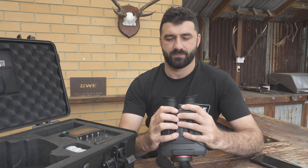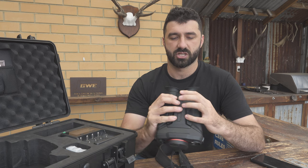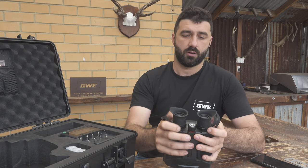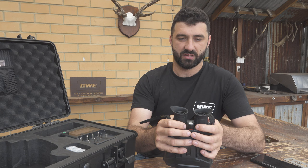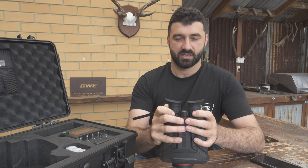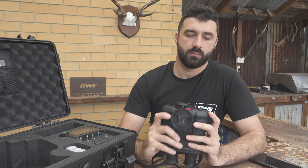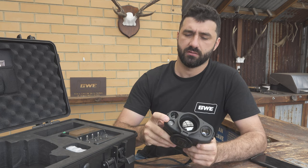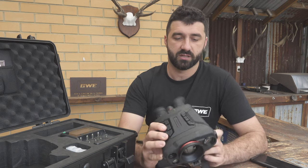The focus knob — I don't particularly like the positioning of that. It's a little bit awkward to reach; you've got to change your hand position. Not the biggest fan, but it does work. The eyepieces have interpupillary adjustment, so whether you've got a skinny face or a wide face you can set them so you can see properly. On the front, there's a lens cap for the thermal lens, then the optical lens, what I believe is the illuminator, and then your laser rangefinder — so it is a laser rangefinding unit as well.